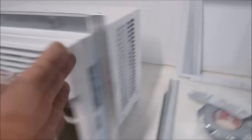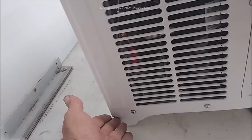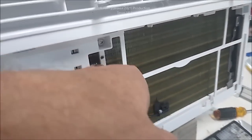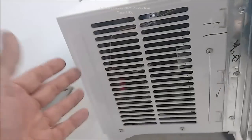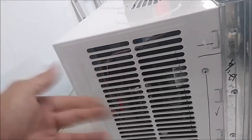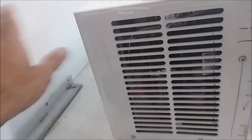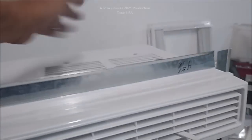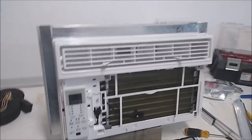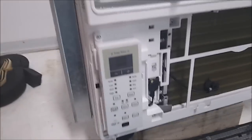The reason for the tilt is for your condensate reservoir down here — to make sure the moisture gets to it so the fan can utilize it. These air conditioners utilize the moisture internally. They have a coated finish now, so they have a longer lifespan. The fan picks up the moisture — you'll hear a clicking sound — and anything that gets to excess will drain out. It allows a little reservoir for moisture to help with heat dissipation, vaporizing the heat out that way. Don't freak out if you see that. The modern ones are all like that — they're a little more efficient that way.